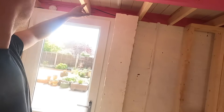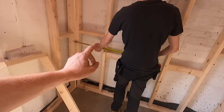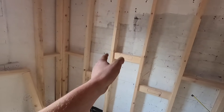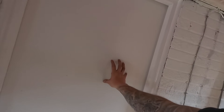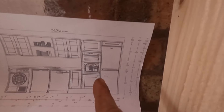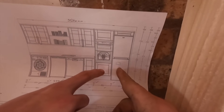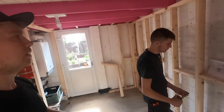The outside light already here is coming up and across into the cupboard outside. We've got three appliances - fridge freezer and dishwasher - all going low level, so we'll do single socket outlets with a grid isolation switch on top. There's a new 6mm cooker circuit going in, disconnected from the old kitchen. With the cooker we'll put the isolation switch in the bottom cupboard with a double socket, and the fridge can plug straight in.